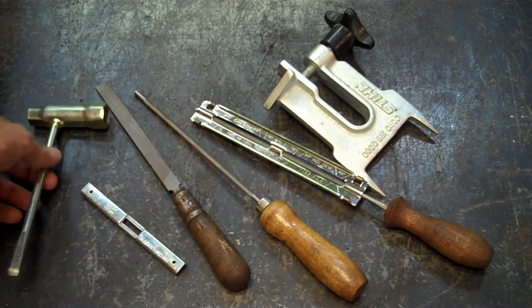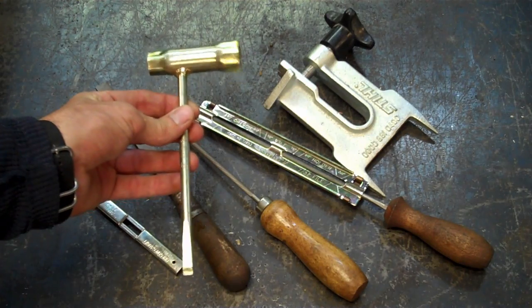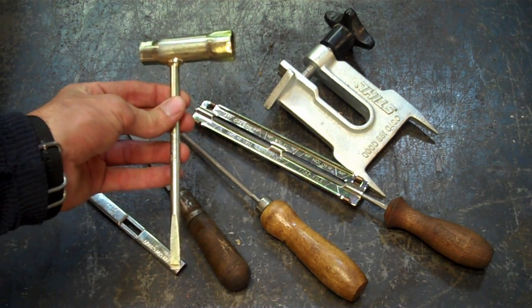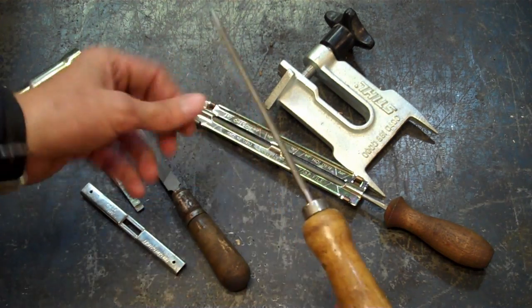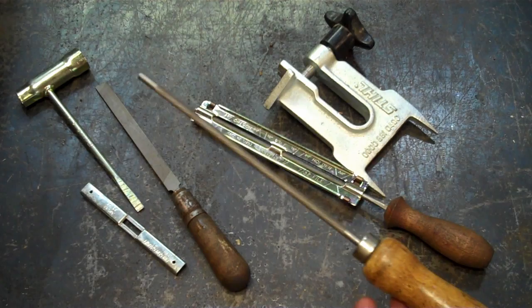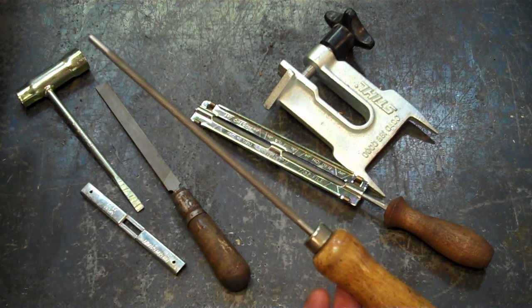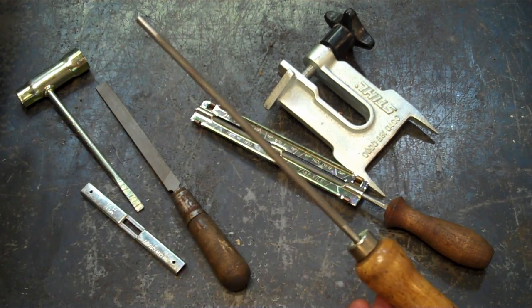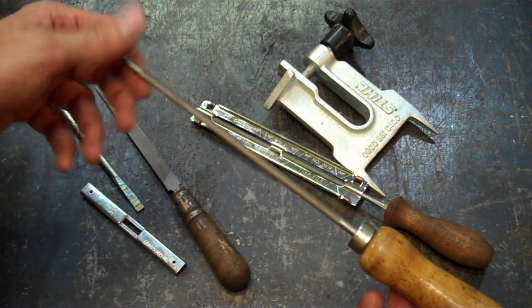From there, you're going to need your bar tool that's going to come with any chainsaw that you buy for adjusting and releasing the bar tension. You're going to need the correct round file, rat tail file. There's going to be typically four sizes that you're going to run into. The smallest is going to be 5/32. I've even seen some 4.5 millimeter, 3/16, and 7/32 for your larger professional saws.